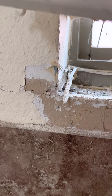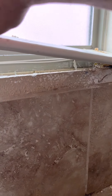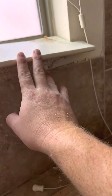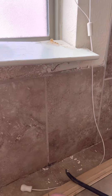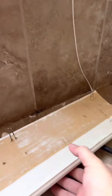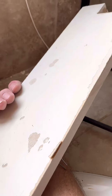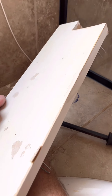This drywall will be here to that little corner, which I can readily patch. We'll get all this cleaned up, cut a new one of these nicely. I'm actually going to make it thicker — we're going to do three-quarter — and seal it a lot better. It should be sealed all the way around since it's in a wet area. They kind of cheated and went to the back, but I don't think they did a great job because it just blew apart with some water on it. I'll see you for the next part.